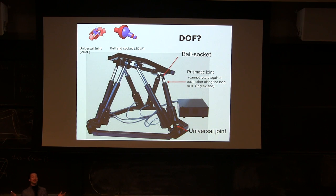And of course you have 6, right? Because you have to be able to tilt, 3 degrees of freedom, and then move in and out, all 3 degrees of freedom, right? You need to get 6. Let's count. How many rigid bodies? 1, and then there are 2 in each member, so 12. So it's 13, right? 12 plus 1. So how many degrees of freedom is that?